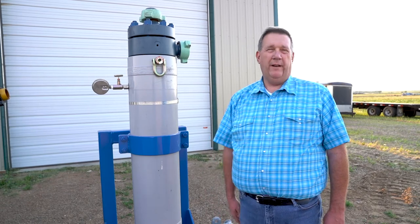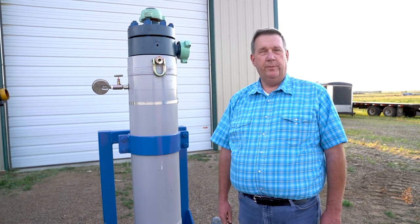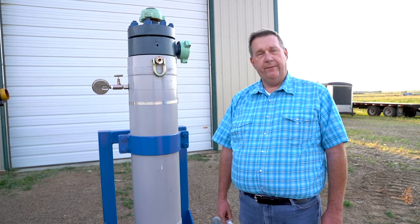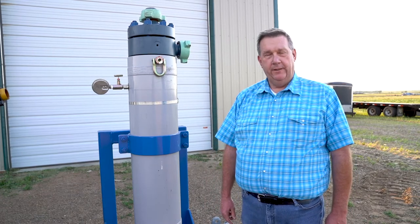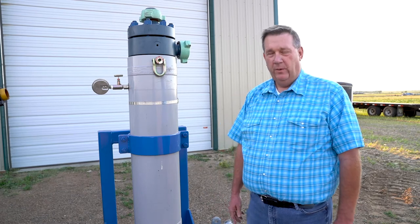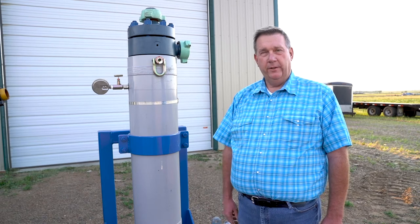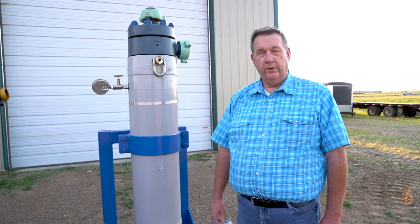If you're so clever, why don't you come up with a way to take sand out of our flow tubes after the flow back guys have left? So after thinking about it for a while, I thought I'm going to take that challenge on. I learned that sand cans and sand separators use gravity to separate the solids from the fluid. This is very inefficient — in fact it's only about 40 to 60 percent efficient — which means there's still a lot of sand left in the fluid going into your valves and chokes.